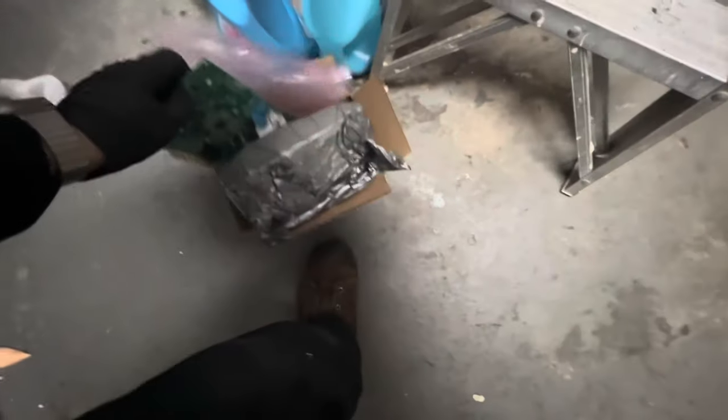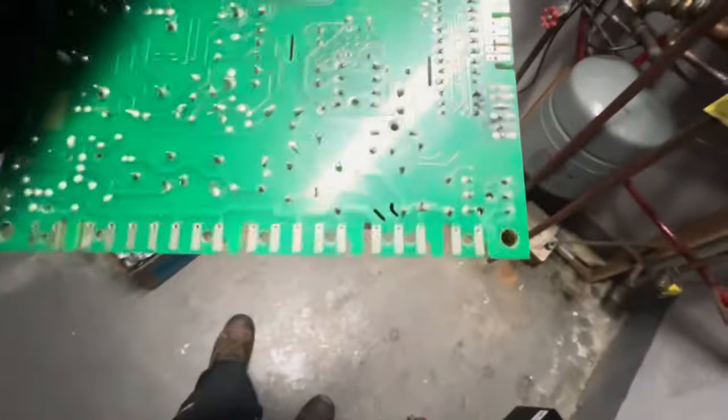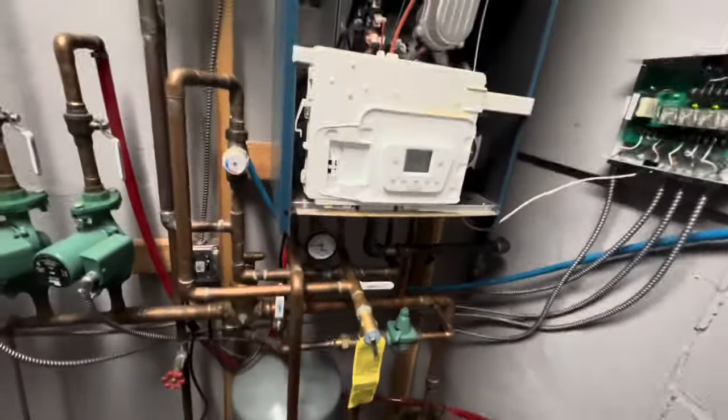When I call tech support, I don't want them to baby me through everything. I just want to know how this specific boiler might differ from others in testing and troubleshooting, because they all work differently even though they do the same thing. I got a control board for it because there was a power issue — actually, no power issue on the incoming: 120 volts, 60 Hz, power to the line, not to the neutral, power from line to neutral, power from line to ground. We got our new control board in. When we took the old one out, we noticed a little bit of corrosion, and there was a good bit more right here from water getting in — that's what fried our control board.